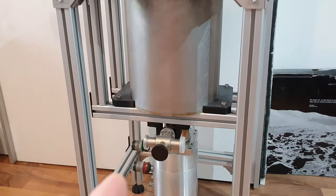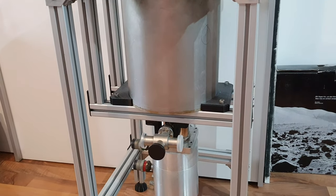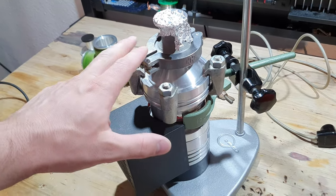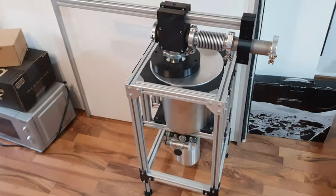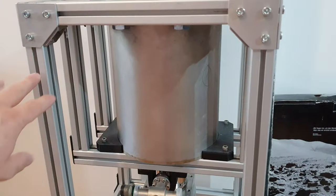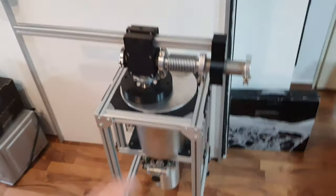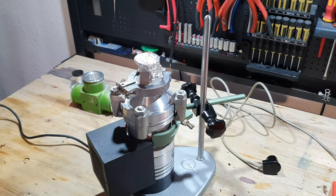The problem is that this pump is really big and quite loud, and it probably has to run for a few hours or maybe even a day or two to get down to the required pressure. Since I now have a turbo molecular pump, I will test it in today's video. If it works, I can disassemble the cryo pump setup and fit the turbo molecular pump to it — making it a lot smaller, quieter, and I can use the aluminum rack to mount the controlling units for the pressure gauges.